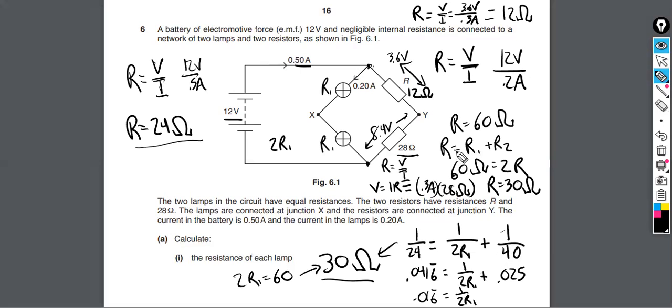Because you have to use the resistors in series, since each of these is in series with each other, yet in parallel with this other set of resistors. And so how do you approach that mathematically? You see what we did is we collapsed down the combined resistance of the two resistors in series into one value, 2R1, 40. We collapse those values into one single value that we can then combine the way we do for sets of resistors in parallel.